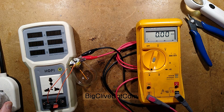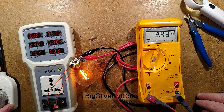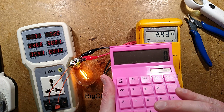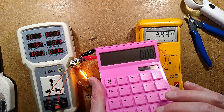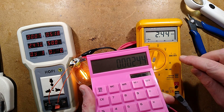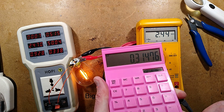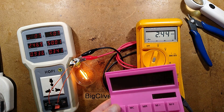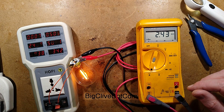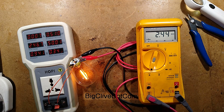Plugging the power in again - 2.4 milliamps. That's a lot less than I was expecting. So the filament is dissipating 2.4 milliamps times 129 volts, which equals 0.3 watts. That explains why it looks so dim. This is possibly because they're trying to take the load off the linear regulator. How unusual.